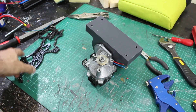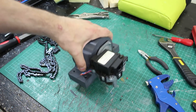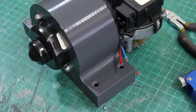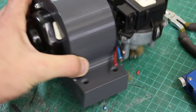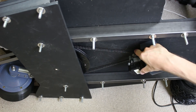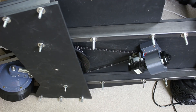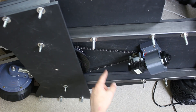We've got a wiper motor in a bracket that fits my chain. This is going to be mounted on the bottom of the board so the sprocket can pull the chain and pull the ends around the pulley. These motors have three wires and depending on which two you connect, you get three speed combinations - I need to find the fastest two for the most responsive steering. I've put the biggest sprocket on for now. There's a problem though: I installed the sprocket as high as I could for ground clearance, but the pulley here is about 30mm from the base and the sprocket is only 10mm up - the chain gets pulled over the guards and pulls itself off.